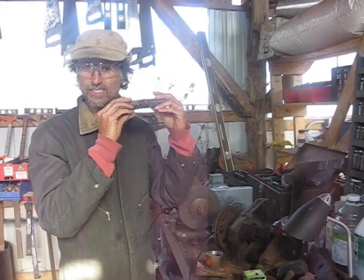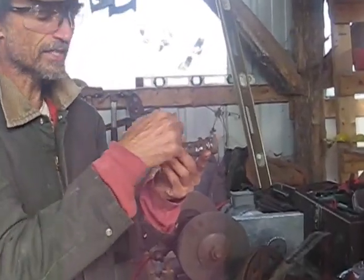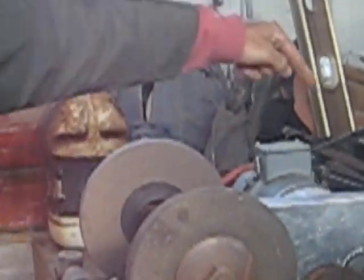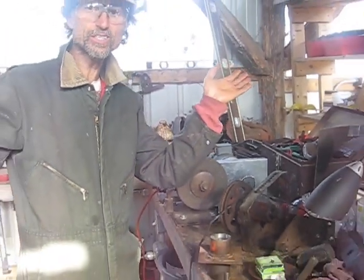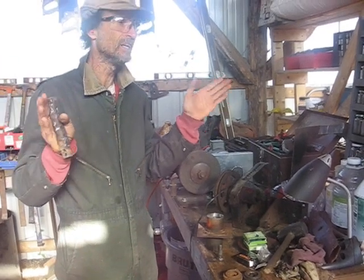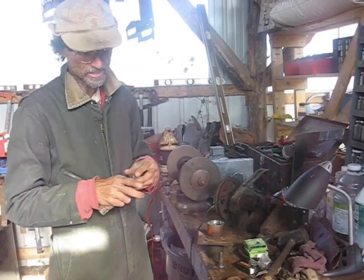I'm going to turn on this motor. This piece of steel is actually a spindle for a mower that got all chewed up. We welded it, and I have to machine it back down. This film is going to show you how we machine with our DC microgrid. When I throw that switch, we're going to have 1¼ plus 1½ — that's 2¾ horsepower of demand on a 1½ horsepower supply. You can't come anywhere near that with a regular AC system. Our system is much cheaper, much simpler, much more durable. All this hardware lasts for decades.